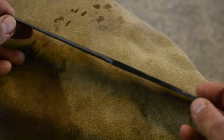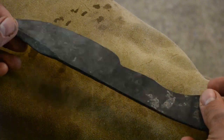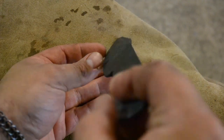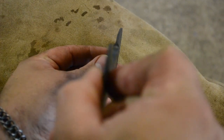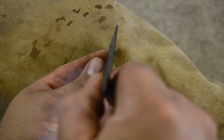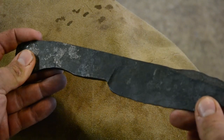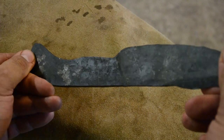A final overview of the blade — you can see that we've got our tapers in, our plunge cut. It tapers from tip to the ricasso and then from the butt to the ricasso. It's dead straight, everything's nice and central. The plunge cuts are central, and that's really important — you want to make sure that your plunge cuts are cut in well.